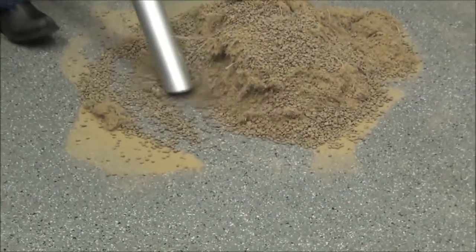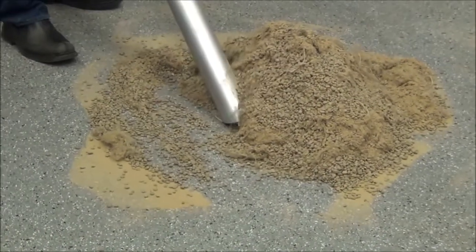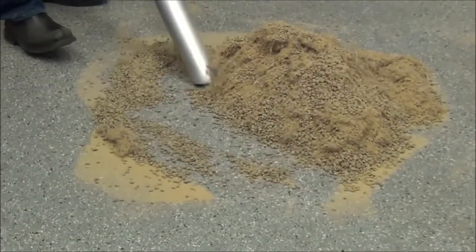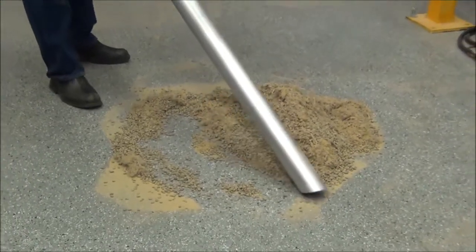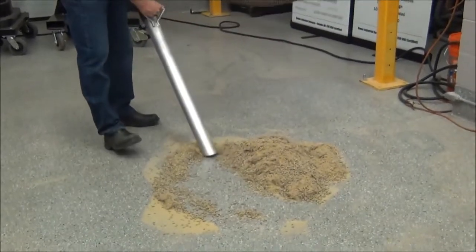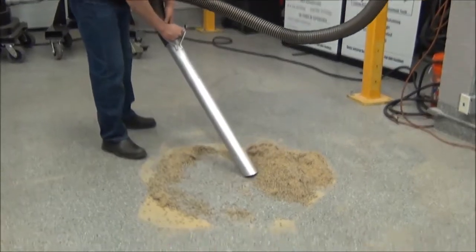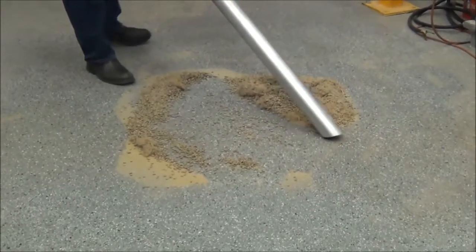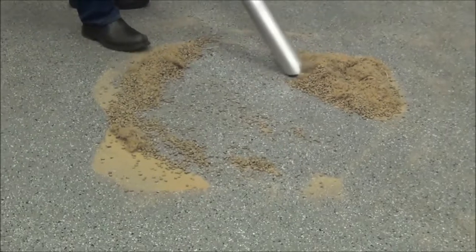We're simulating that you can pick up bulk products all at once, carrying that up 15 feet and back into the vacuum. This is a 40-foot hose. The vacuum is a DS2720EX 500 CFM with an ATC on the front of it. The cyclone is actually spinning all the material out of the airstream, and what you can't see in the video is this material is extremely dusty. So with our 0.5 micron filter in the vacuum, none of that dust is going to escape.